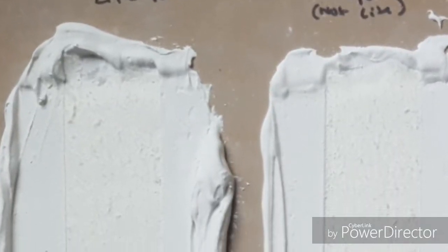Very good adhesion — impressive, and probably one of the best products available at big box stores. So, is there one compound that works better than another for taping? Looking at the results again: quick set and quick set light show almost perfect adhesion — you see no clean spots, only paper that is delaminated where the layers actually came apart.